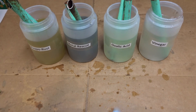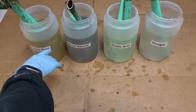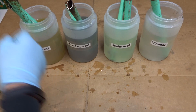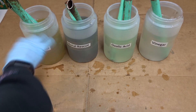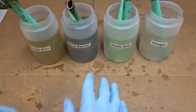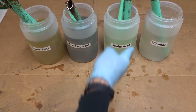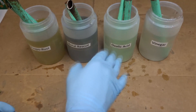These have been soaking now for 24 hours. A couple things I did: after about five hours I decided to go ahead and replace the Evapo-Rust with fresh Evapo-Rust. I thought it would be fair since the rest of the stuff was pretty fresh, so that's been sitting in there ever since. The oxalic acid I checked at about 12 hours and it seemed to be working pretty slow, so I decided to add another half tablespoon of the oxalic acid crystals into there.